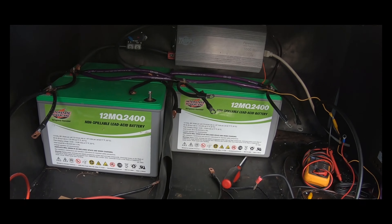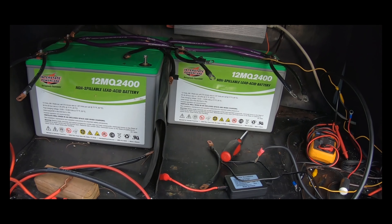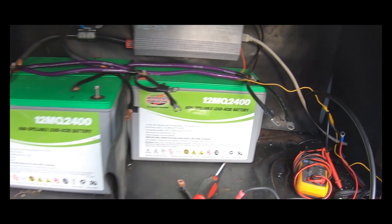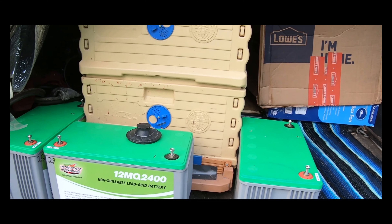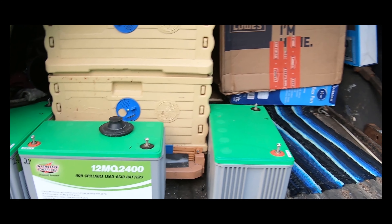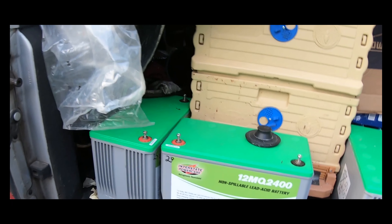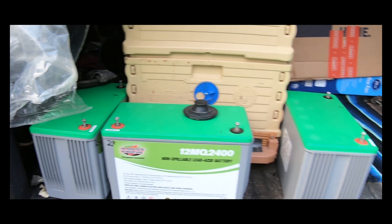So I know there is an issue. To troubleshoot that, I have to tear down the entire battery bank. I had six AGM Interstate Power Care batteries in here. I'm tearing it all down one by one — I'm halfway through it right now — and I'm taking them all over to my truck. Once I get them all out, I'm going to label each one with its current charge status, whatever the voltage is. I'll check that in the morning. Whatever battery drops the most overnight — say from 13 volts down to 12.5 volts — I'll know that is the culprit that's not holding charge and is sucking all the other batteries down.